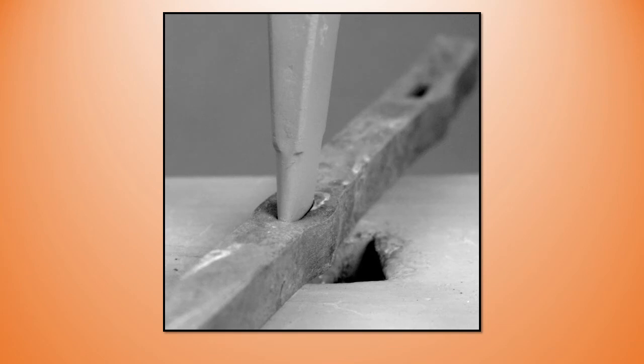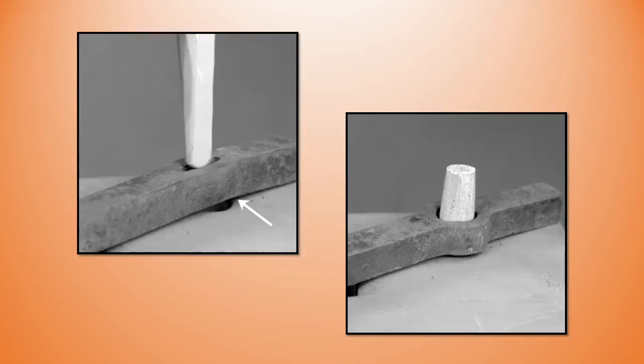I'll clear the slug over a suitable void. If your hardy hole is particularly small, you might want to build something to put on top of your anvil or mount it in a vice to give clearance for your punch. I'm going to drift from the crown side because I'm trying to straighten the bar as I work. Make sure your drift has clearance — if you're using a half-inch drift over the pritchell hole, make sure it actually clears the pritchell hole. I've pinned my drift into the pritchell hole more than once or twice by working too fast.